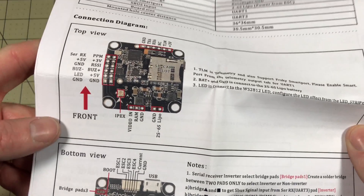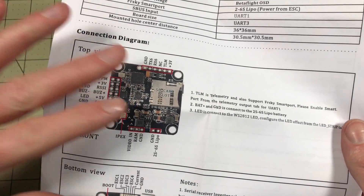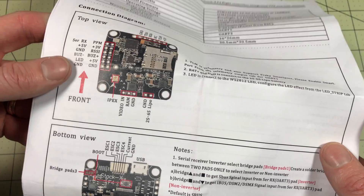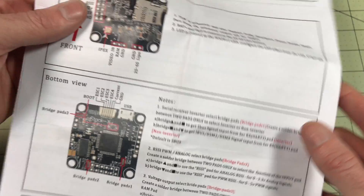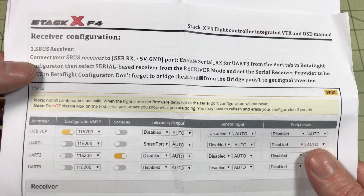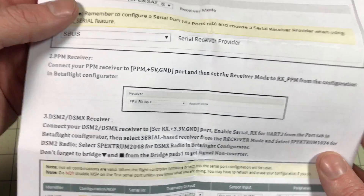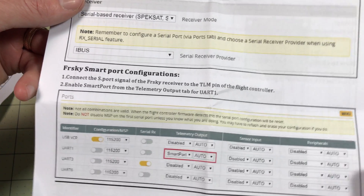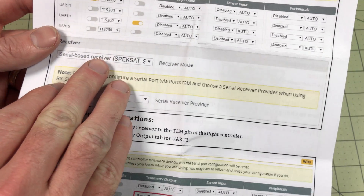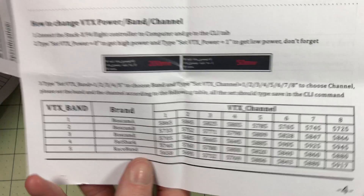This does a really good job of laying out where all the connections are. And really, drone manufacturers, this is all I'm asking for. This is just printed color paper, but it details what all the parts are for — and so many people are lacking that. It shows you what you have to bridge in order to get the different connections in place, including the specifics depending on what receiver you have. I'll be using SBUS, which is the default from the factory, but it shows you what UARTs to use, what pins are bridged, so you get signal inverters if you have a PPM connection or a DSM connection. There's also FlySky SBUS receiver instructions and smart port telemetry configurations.